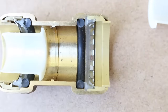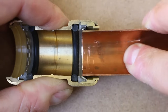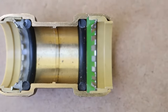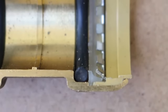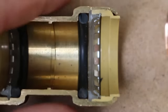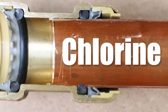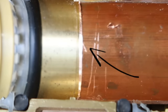The third component are the stainless steel teeth that give SharkBite fittings their name. Once the pipe is inserted, the teeth grab onto it and won't let go unless a special tool is used to release them — this is known as the first stage of completing the connection. The fourth component is the o-ring support, which gives the pipe rigidity inside the fitting and protects the o-ring by keeping the pipe centered during insertion. The fifth component is the EPDM o-ring, whose sole job is to prevent water from getting past it. Unlike ordinary faucet o-rings, the EPDM o-ring can take decades to dry out and can withstand harsh chemicals such as the chlorine used to clean municipal water. As the pipe is inserted all the way, it reaches the stop — the second and final stage of completing a joint.